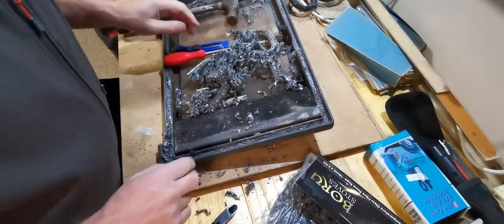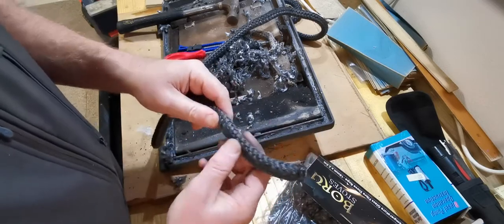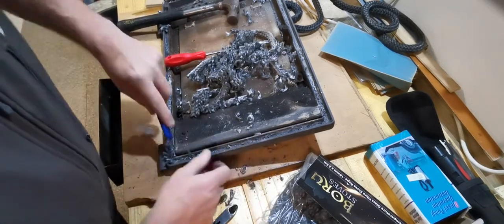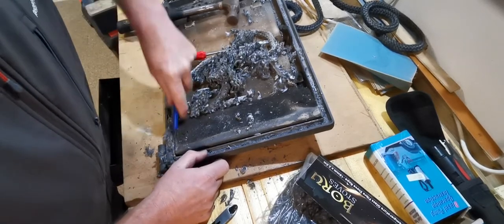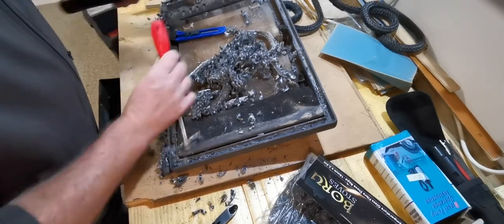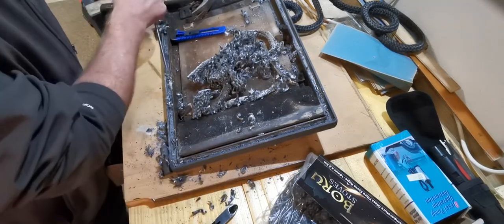I think this is probably the third rope that's been in it - I've had this for the last three or four years. The important thing about replacing the rope is that this door is compressed in, so you're trying to stop air leaks and drafts. I noticed last winter that there were quite a lot of drafts coming in, and I could also tell as I tightened the door that it wasn't really that tight, so I knew I needed to replace this.